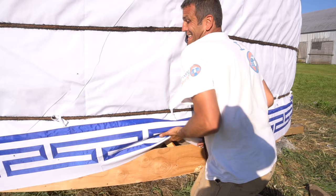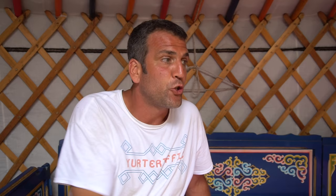There are ways to take care of this. If you don't use your yurt regularly, there are different ways to ventilate it. If you use it, you can simply lift the sides. Otherwise, we've seen people putting vents in their platforms, even having a little fan — it could be a solar-powered fan — so that creates a natural draft with the dome. We've also seen people cutting a panel at the bottom of the door and putting mosquito netting, so you can have ventilation while you're away.